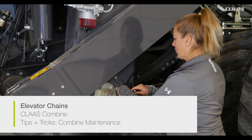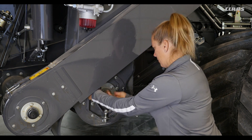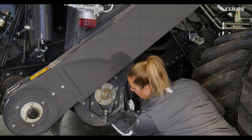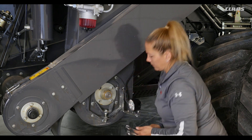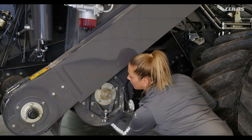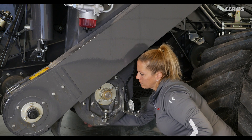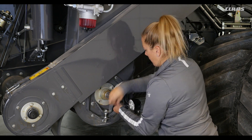Next, let's look at the two elevator chains. To inspect, remove the door from each elevator boot. Proper elevator chain tension is reached when the chains are tightened to a point where they can still barely slide side to side on the sprocket. If they can't slide side to side, they are too tight. If they move easily or are hanging at all off the bottom of the sprocket, they are too loose and can be prone to breaking if left unmaintained for too long, and can increase the potential for grain damage. To adjust the clean grain elevator chain, loosen the four nuts on the face of the elevator boot as well as the jam nut on the draw bolt and rotate the lower nut on the draw bolt clockwise, pulling down on the shaft and tightening the chain. Be sure to check how the chain slides side to side on the sprocket as you make each adjustment.